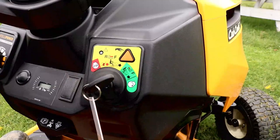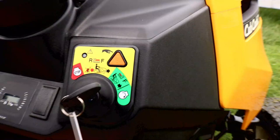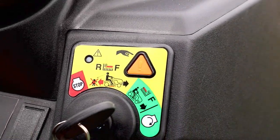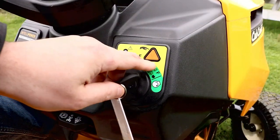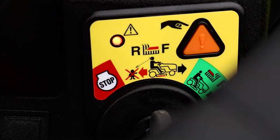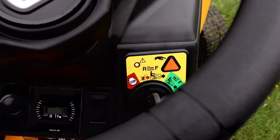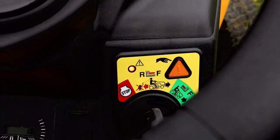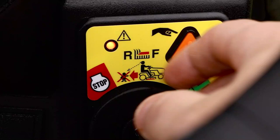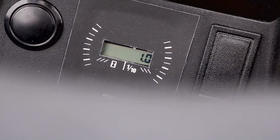Let me show you one safety feature. If you have kids running around the yard and you've got to throw it in reverse, before you can go in reverse with your blades on, you have to push that button, then flip your key to neutral and push it again while the mower is running. That's the only way you can go in reverse with your blades on. To disengage, turn that key again and flip it back. When the red light turns on, that's telling you that you are now able to mow in reverse. You also have your hours-used meter right up front.